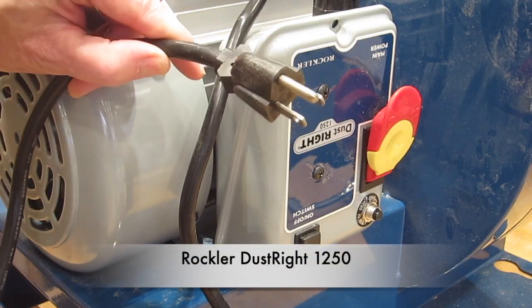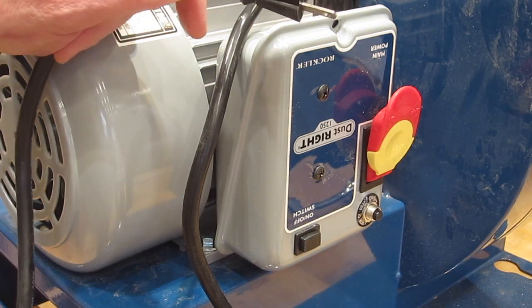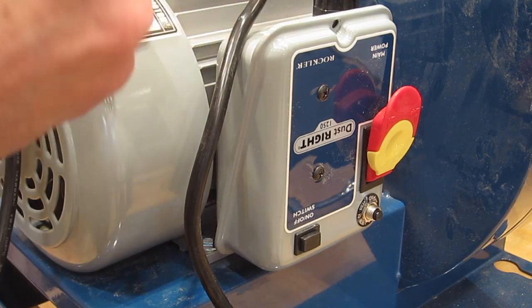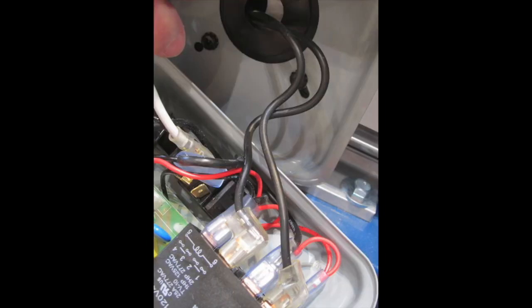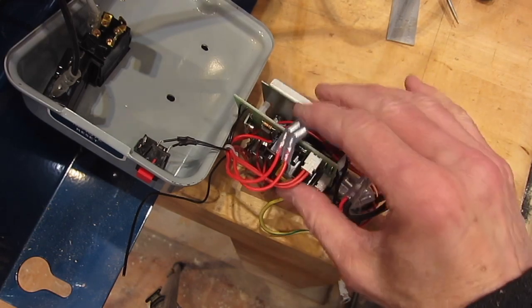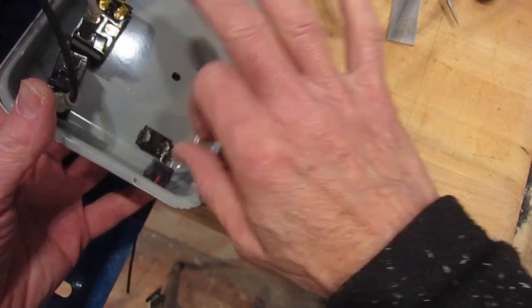When the power is cut off, the unit stops of course, and the only way it will restart is if you push the start button or use the remote. You can't simply reapply power and have it restart. Therefore it will not work with an automatic dust collection system, because the automatic system wants to start it by applying power. So I'll take careful photographs of the internals so it can be put back together in the future, then rewire it so that it is driven entirely by the power. Everything came away nicely thanks to the stab connectors, except for this little red push button — they've soldered the wires on — so I'll warm them up with the soldering iron and pull them out.